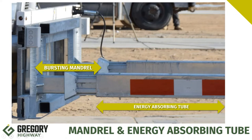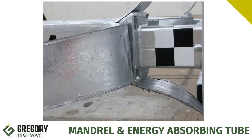When a tapered mandrel with a square cross section is forced into a square tube with smaller inside dimensions, the mandrel pushes against the inside of the tube. Outward force on the inside of the tube concentrates stresses in the corners and creates a controlled cracking of steel. As the mandrel proceeds forward, the tube is split into four flat straps of metal that are curled outward by the flared portion of the mandrel.